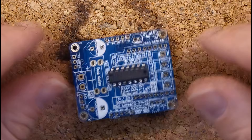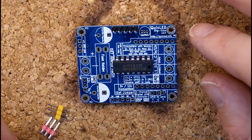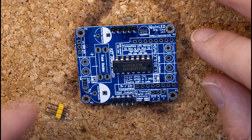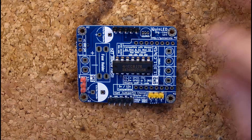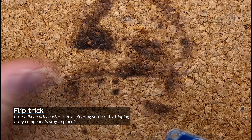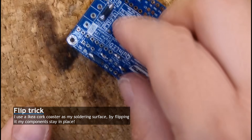Let's continue with the pin headers. You need 2x5 pin headers and 2x3 pin headers. I use different colors for the voltage and GPIO selection because that differentiates them — and especially for the voltage selection, if you get it wrong you might blow up some components. That's why I like using red pin headers and a red jumper later on.